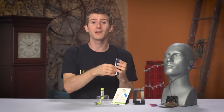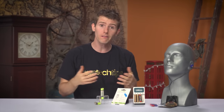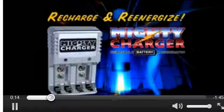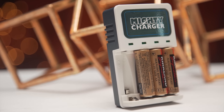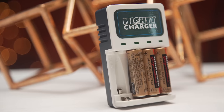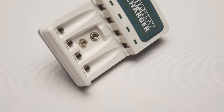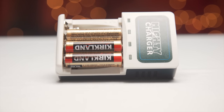I set up a safe space to recharge them with nothing flammable within four feet in my garage. My recharged batteries ran for less than half of the time of my original test, but I've since done a lot more research on the topic and, yes, alkaline batteries can be recharged. It needs to happen in bursts to keep the battery acid from leaking out the pressure release valve, and it works best if the batteries aren't fully drained — and even so, you'll only get ten consecutively shorter cycles. If you're lucky, compared to hundreds or thousands on a proper NiMH. But for items like kids' toys, where I don't want to invest in expensive rechargeables that I'll probably end up losing when they leave their junk outside in the rain, this is a great solution.